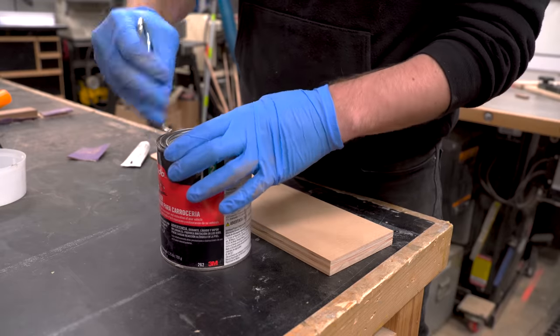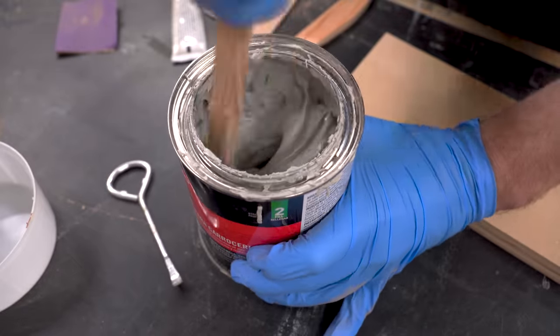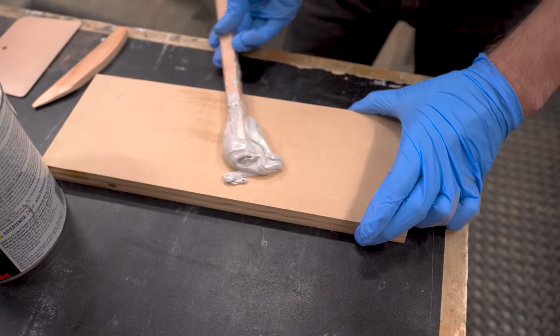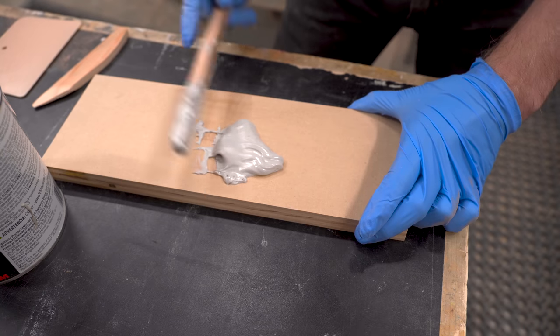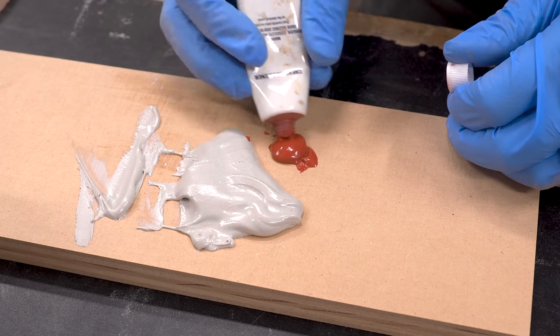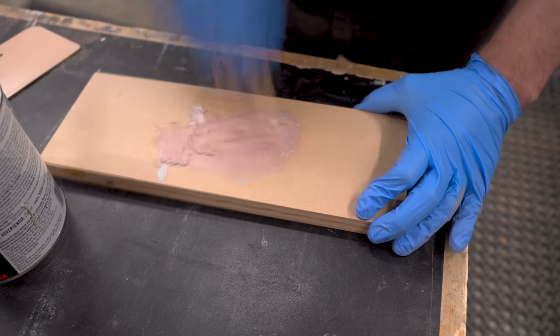Notice this cabinet is covered in scars and there's areas where the plywood is torn out. So I decided to Bondo the surface of it to get it nice and consistent. Bondo is usually used as an auto body filler, but it actually makes a great filler for woods, especially if you're veneering or painting over the top of it.